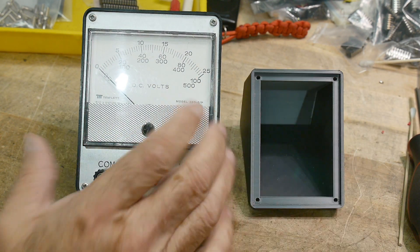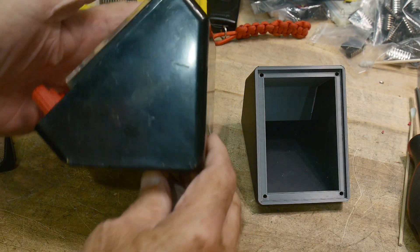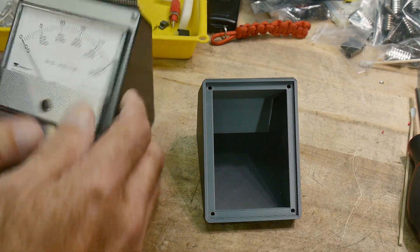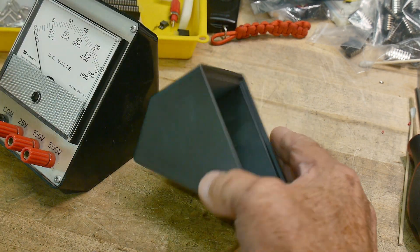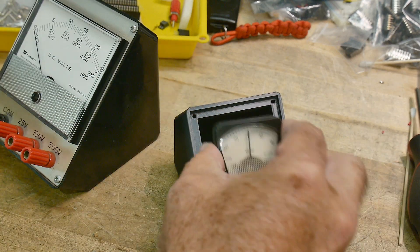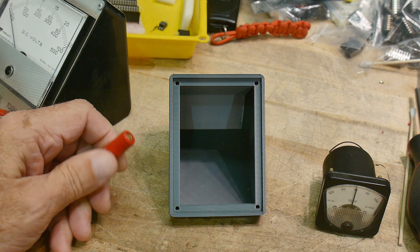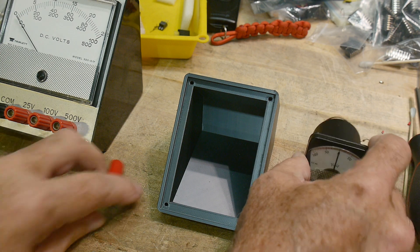I wanted to make a baby brother for this meter. I have this meter that I want to make a case for, so I took out the design of this case - it's a 90 degree, 45 degree bezel design. I designed this one and 3D printed it. The meter in this one is shallow and didn't need a lot of room in the back, where this one, for the aspect ratio, is pretty deep, so my angle has to be a bit different. It's still a 45 degree front with a 90 degree corner. It'll sit in here nicely - I have some banana jacks that will match for the front. All I need to do now is make the metal piece that goes in here and put it all together.